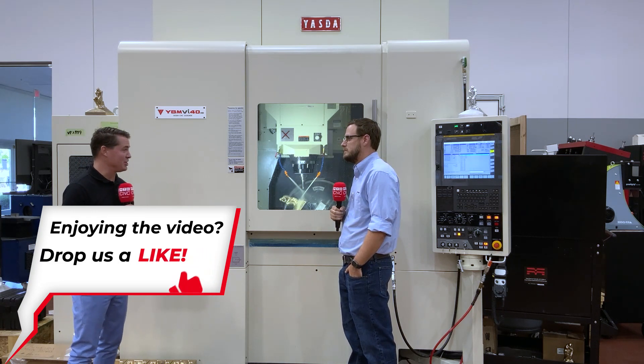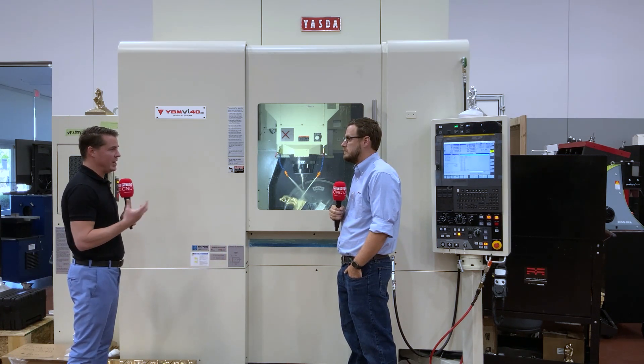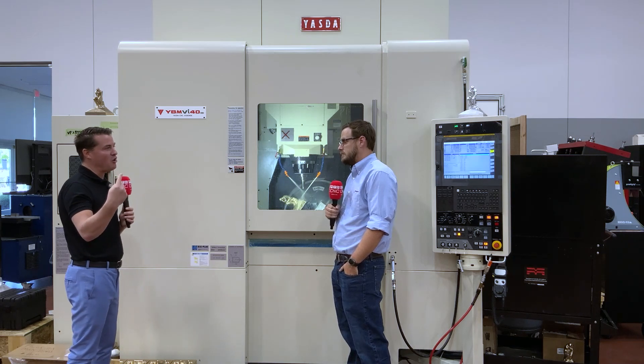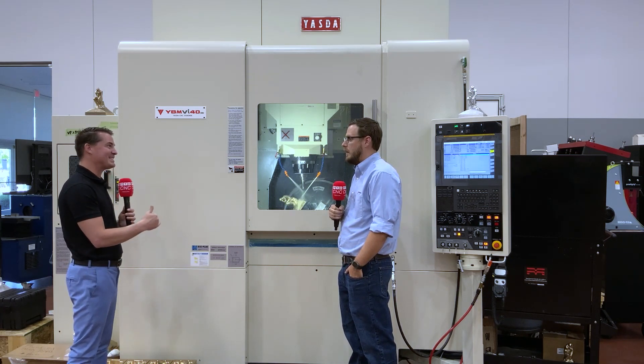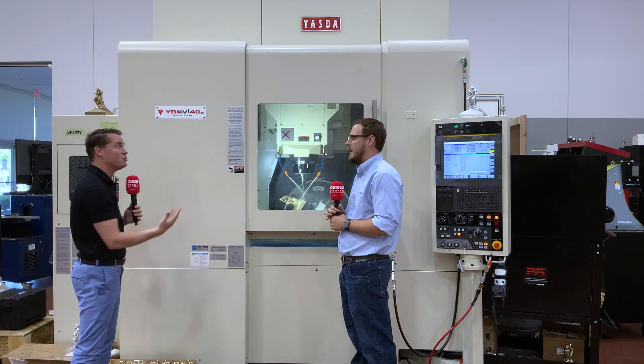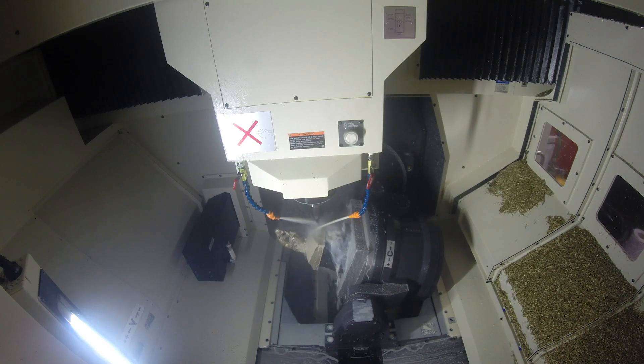I would make the argument that having a slightly slower tool change — if I have 30 parts coming off a machine and I only have to check one of them, in the overall cycle of my life, I have less downtime checking all my parts versus that four or five seconds on a tool change. Absolutely. Especially if you get a pallet changer — you check that last part, if it's good, I promise the others in front of it are gold. Add a probe and let it do its comps for you, you just made yourself all kinds of money, just sitting there printing money. I ran 400 parts holding two-tenths tolerance and lost three out of 400 — that was it, because my tool was wearing out. Other than that, the machine cuts it. You tell it to do it, it's going to do it.